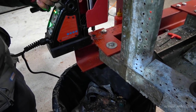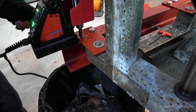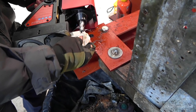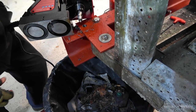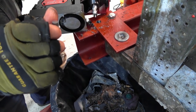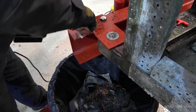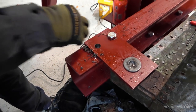If you try doing this with a normal drill you'd never do it. What sort of drill is that then? It's a mag drill. It's not like a normal drill bit — it actually cuts a circle, and then your spring-loaded pin in the end pushes the little slug out — that's the centre of the hole. It doesn't actually cut like a normal drill. You get absolutely precise holes, reamed out and everything. Absolutely perfect.